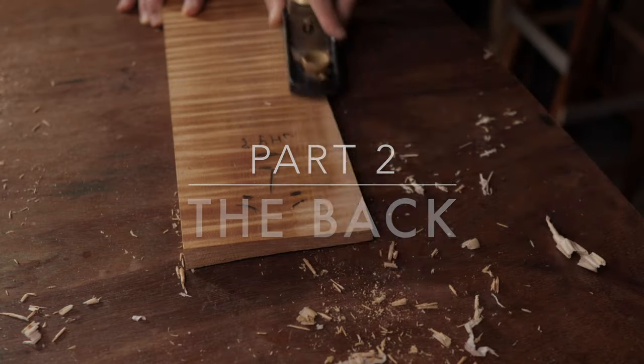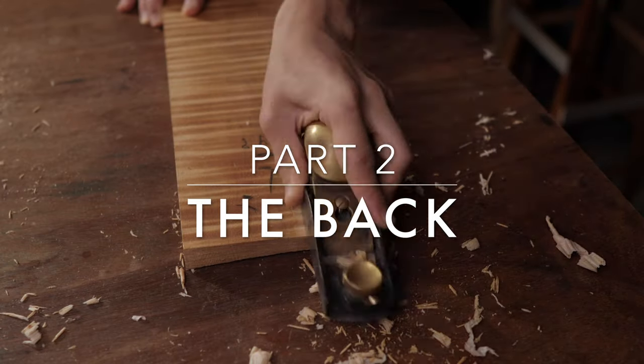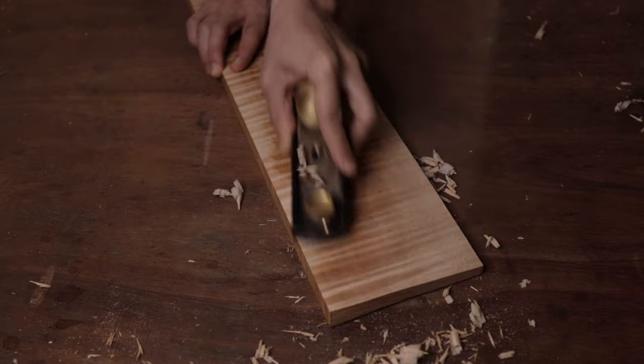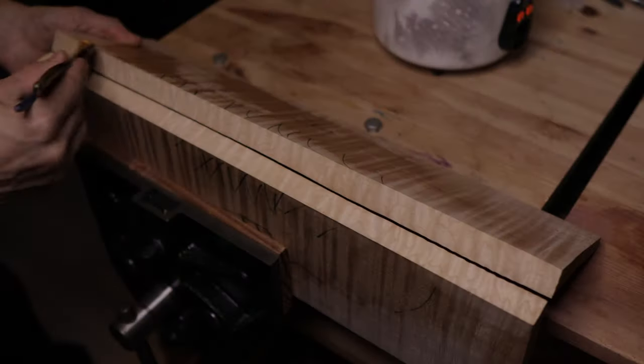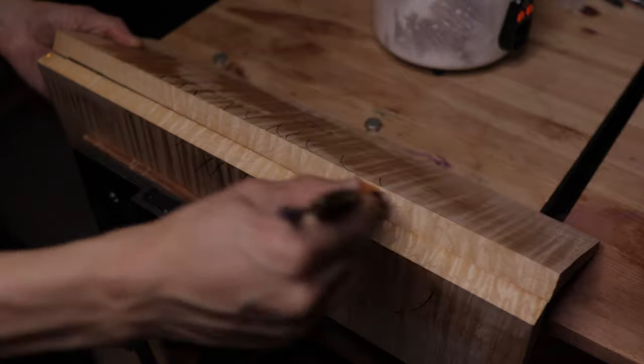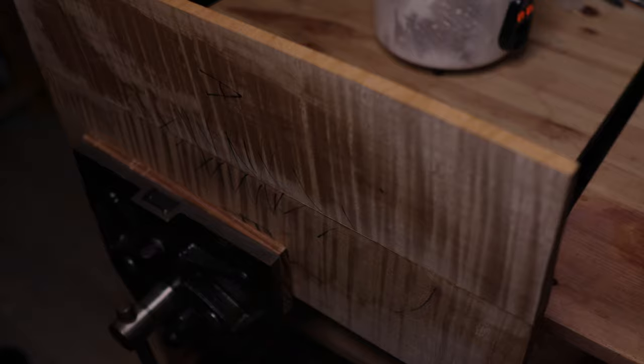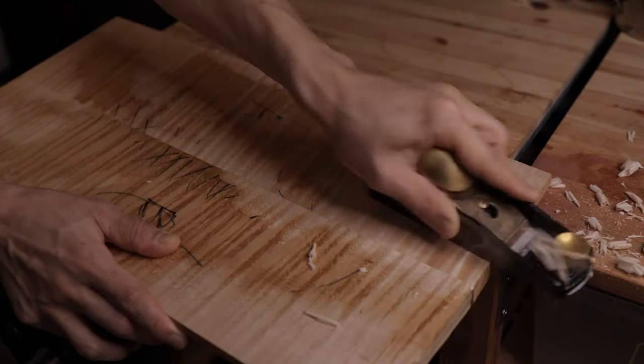The wood we use for the ribs and the back is called maple. The pattern you can see there is called flame or figure. That's why some people call it flame maple. This may be contrary to what you have heard before, but if the edges are both square enough, you don't have to clamp them.